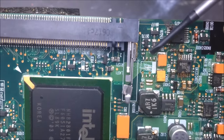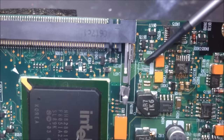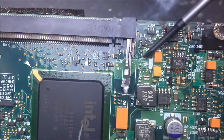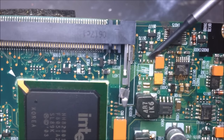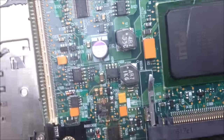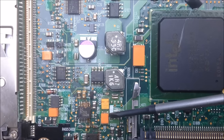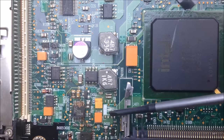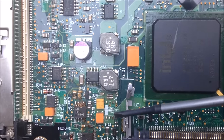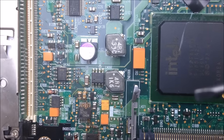You'll notice that these pins are tied together. And this lighter material has copper underneath it. I've scraped away some of it right here, and you can see the copper. And this dark material doesn't have any copper underneath it. So, these 3 right here, looking at it actually from this direction, probably a little bit less confusing. So, figure this is pin 1, pin 2, and pin 3, which are usually your source. And here's pin 4, which is your gate. You'll see that these 4 pins right here are connected, which are the drain.